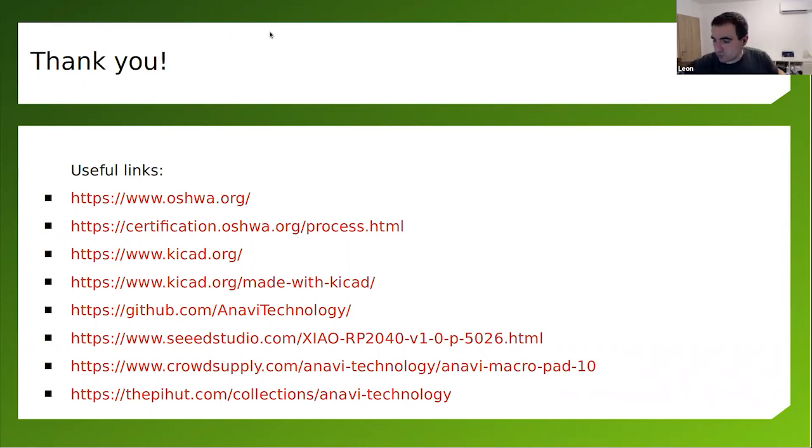One cool thing that I do, and I have an example here, is that after making the board, before placing an order with the company to manufacture it for you, there are many companies. Actually, I didn't mention this, but there are many companies out there, even in Europe, in the UK, in the US, you have OSH Park, and also in China, like PCBWay, JLCPCB. They're ready to make boards for you. However, no matter how fast shipping you select, it will take at least a few days. So what I do is print something like this. This is a sheet of paper. I cut it, and after that, you see this piece of paper, and here is the board.